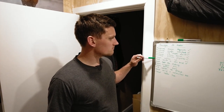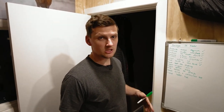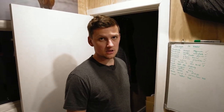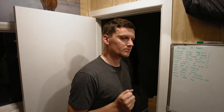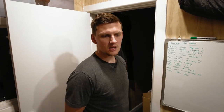Tonight I've cleaned the action up, all nicely cleaned, and I'm about to go and find the lands of that new chambering. I want to start my load development around 15 thousandths off those lands.